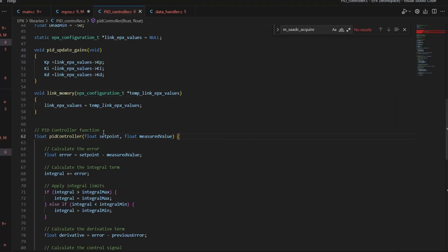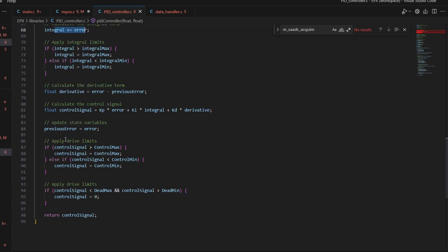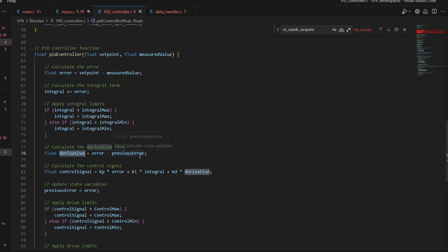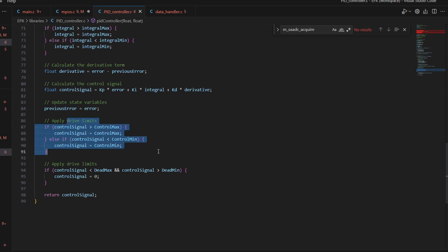I need a control loop. When I say control loop, I mean we measure the angle and compare it to the target. The easiest way of doing this is what's called PID — proportional, integral, derivative gains. You find your error over time, you find the change in your error, and they all have different gains for different purposes. I tried a couple of different tuning methods and I'm kind of happy, but I won't cover that now — there are 80,000 videos out there on PID.